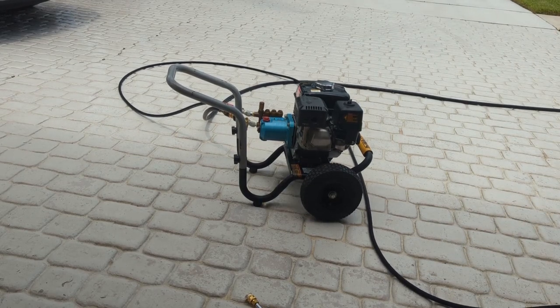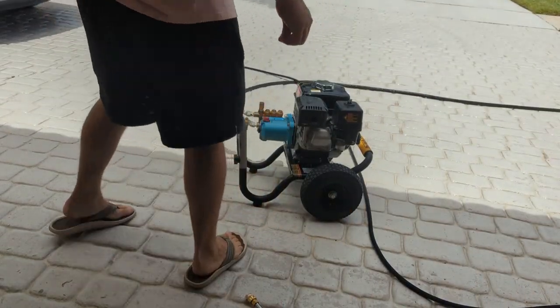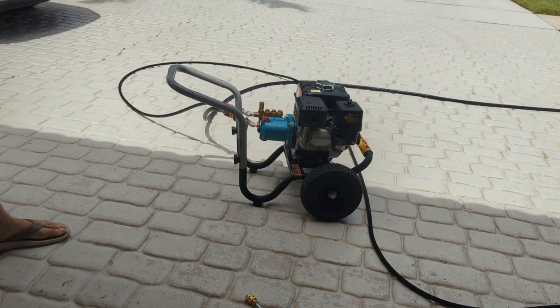The pump works pretty well. So anyway, I hope this video helped you. If you have a Cat 3DX pump that is not producing any pressure, just to summarize, this one needed a seal and a valve kit. It's kind of expensive to do, but these pumps are expensive to buy, so it's probably worth it in the end.